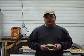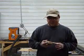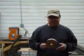With that information, we're ready to cut. What I did is I made some test cuts at our 15 degree angle to make sure that we have indeed a 15 degree angle. And if you're off the tiniest little bit, by the time you make 12 pieces — which are cut on both sides, so 24 cuts — the cumulative error really adds up and you wind up with a large gap at the end when you try and put the last piece in. So accuracy is essential. I made some test cuts with my first setting and they actually look pretty good. I got lucky this time.